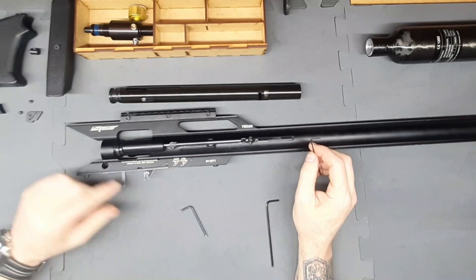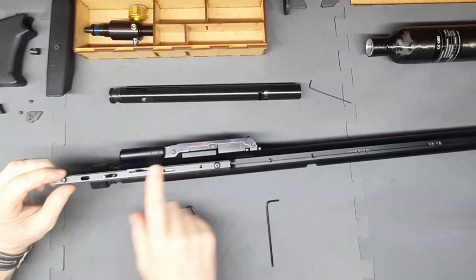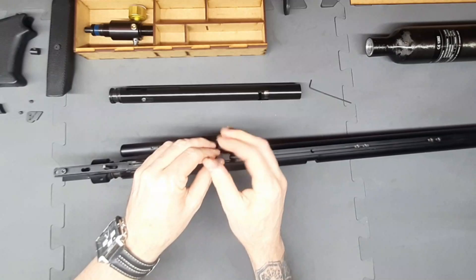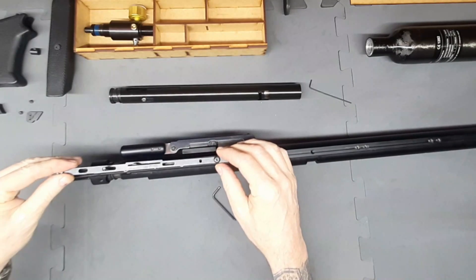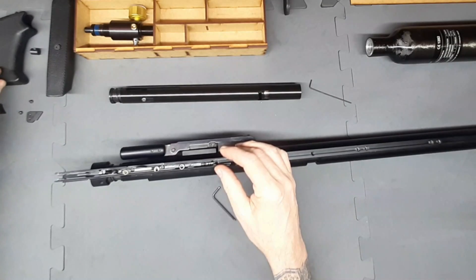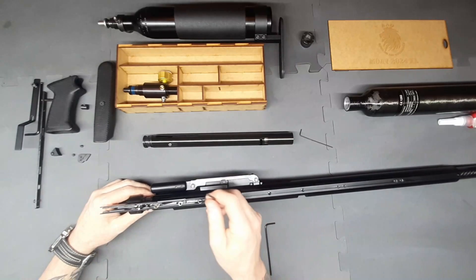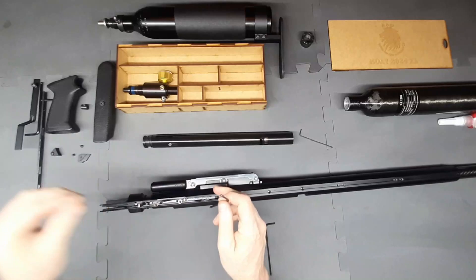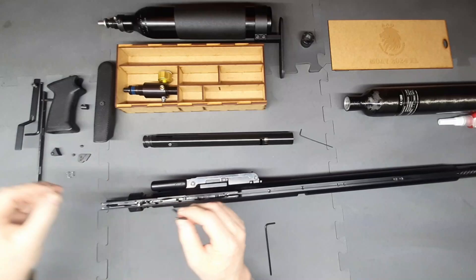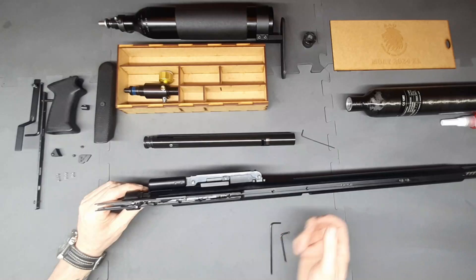So that's the safety blade removed. Next we want to remove the bottom plate — this is the trigger grip retaining plate. I find it's best to leave all the screws in with the actual part you're removing. Then we want to remove the three springs for the trigger grip — always remember the shortest spring goes in the middle.